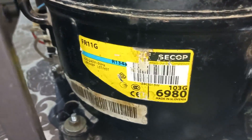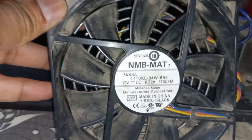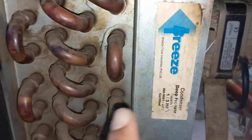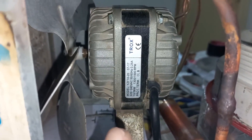I used here an FR11G 10FOS 1/3 HP compressor. This one is a cooling fan for the compressor — its data is 12V 0.7A. Next, the condenser is copper, 1/3 HP, pure copper. The fan is 36W 0.25A.